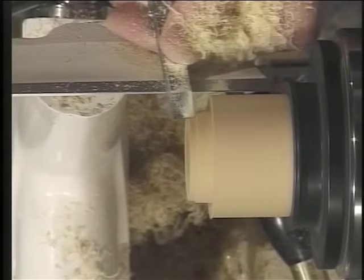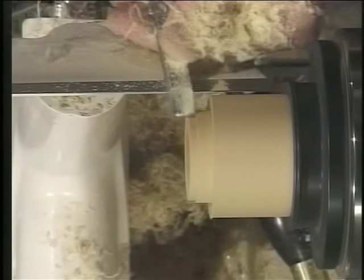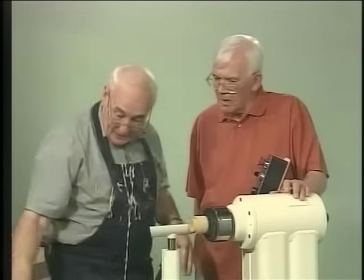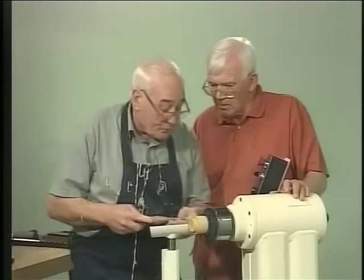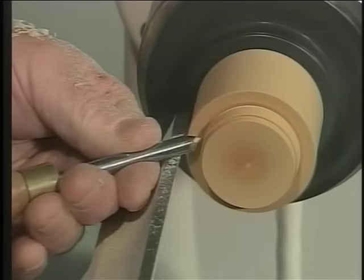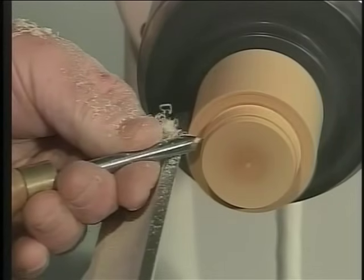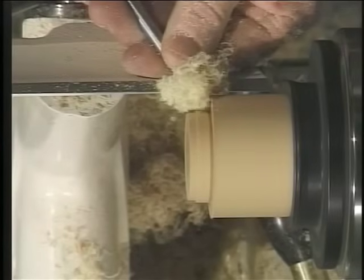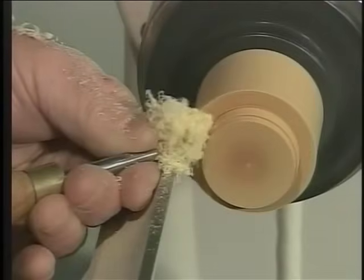And that's my spigot there. Now again, I need that little avenue to pull the tool off quickly. So I'm going to use the point tool. The point tool is going to serve two purposes. First, it's going to cut a little groove at the back there. That's it there. And then it's going to dress up the face. So the face is all finished in one movement.